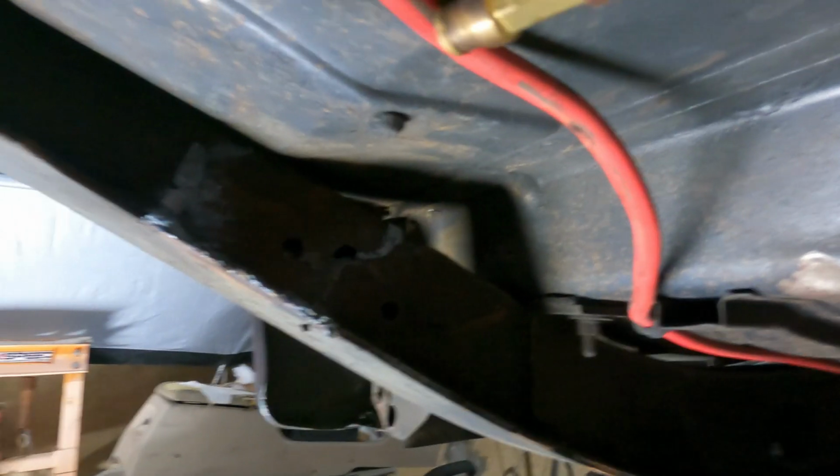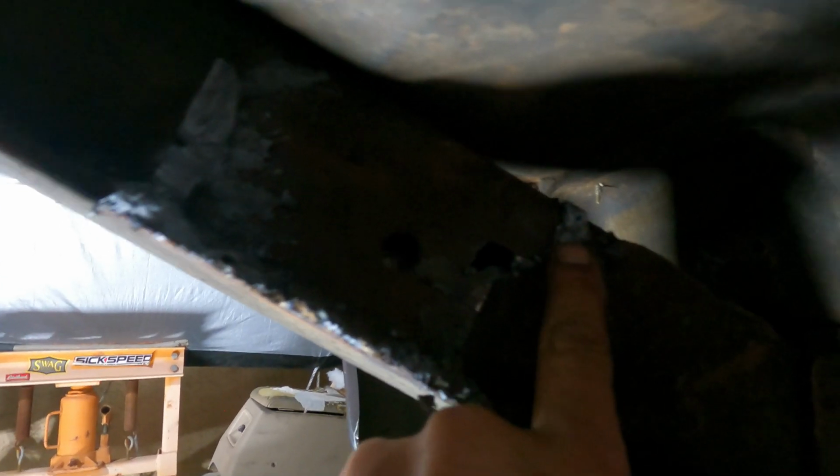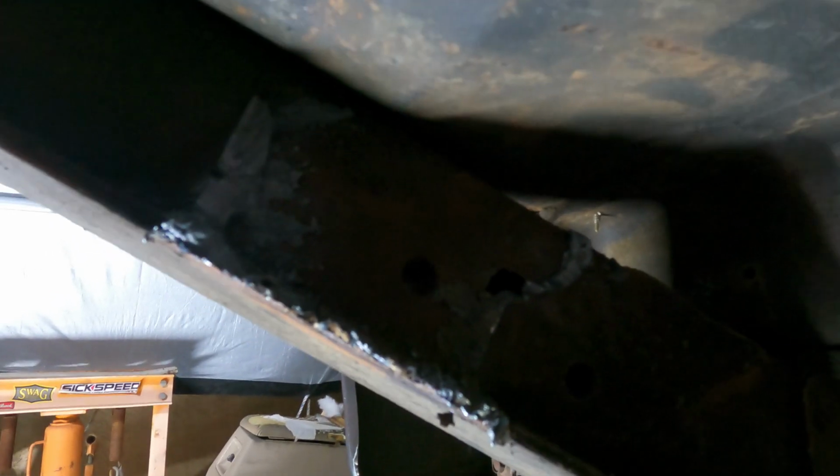Cut till about back here somewhere. So we'll have to weld that up, regrind it, weld the little corner up, regrind it. And then just smooth that out. Smooth that out maybe a little bit more, but it looks good. And that's what we'll have to do over on this side, so you can see more or less what was on there. This little bracket here, bracket here. And yeah, that'll probably come right off.